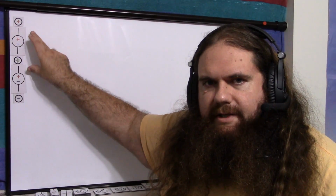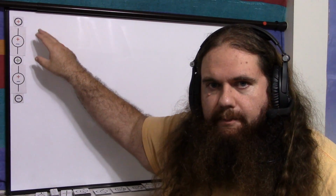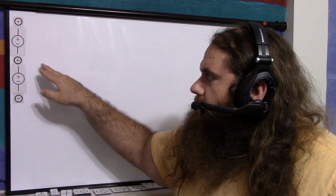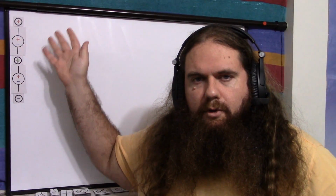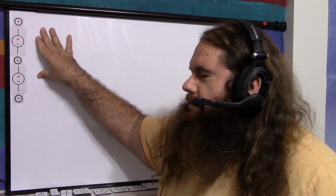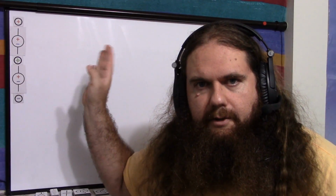Make sure that your positive and negative voltages are the same, for example, plus or minus 7 volts, so that your circuit ground is right in the middle. And of course, the total voltage of your supply is so that you have headroom, enough power to supply whatever load you need. You just make sure you have enough power. You know how to do that for your circuit.